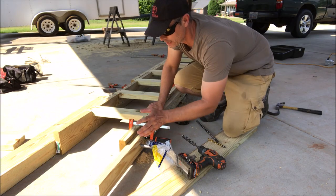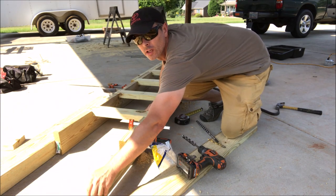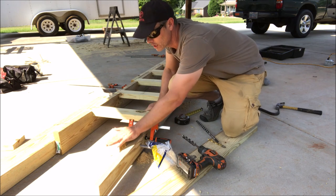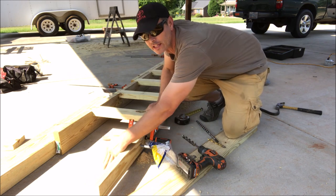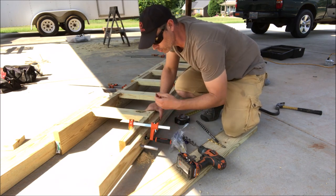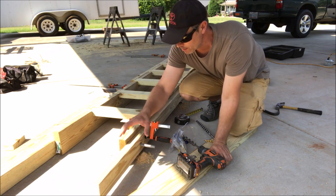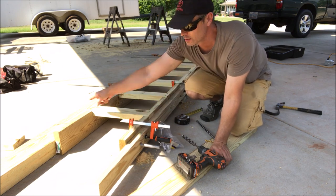What I'm doing now is attaching an extension on top of what's going to be the ladder — really as a handhold. When you're getting up onto the platform, which is going to be about this high, you've got a little extra to hold on to as you're pulling yourself over. That's usually one of the problems I find with some of these stands where it's just a platform on top of the ladder — you're really belly crawling up onto a flat surface. This gives a little extra handhold. It's attached with galvanized through bolts, including a 5/8-inch through bolt that's also going to attach to the platform and secure the handrail down to the ladder.